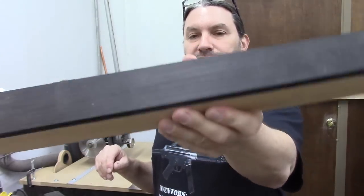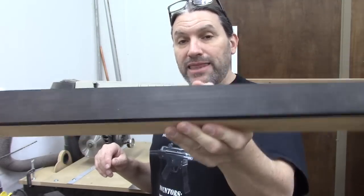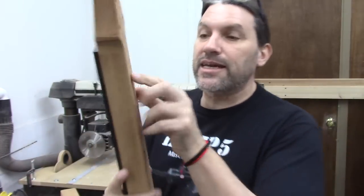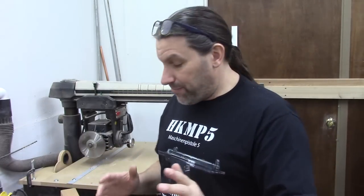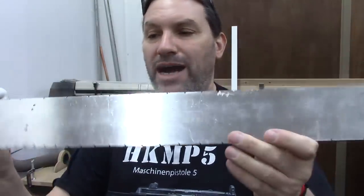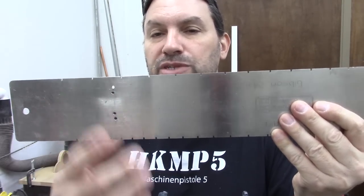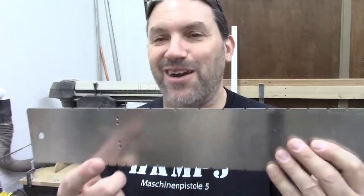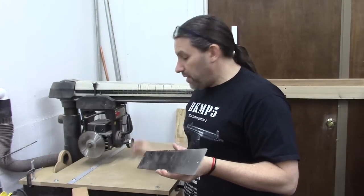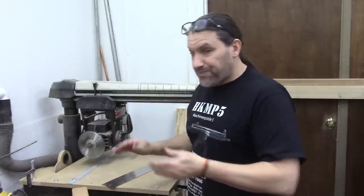Alright gang, we've got our binding slots done and now I'm going to show you how we get a neck ready for fret slotting. The key is these little holes here — they line up with all the necks, because every neck has the same holes. They accept eighth-inch pins and they line up with this fret slotting guide that I got from StewMac. I modified this one to have the holes. The important thing is that these holes are in the same spot on every neck that we make, and that's the key.